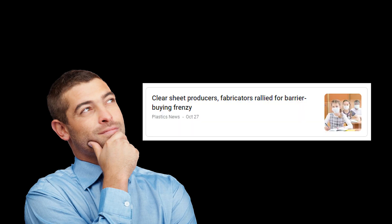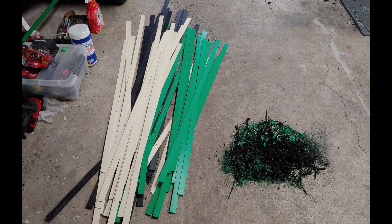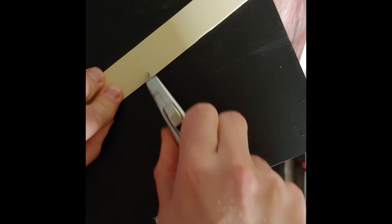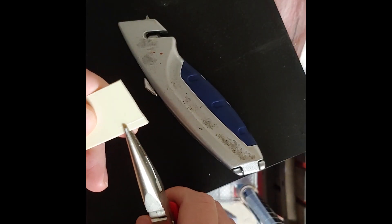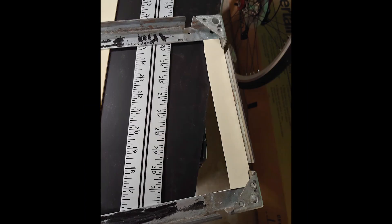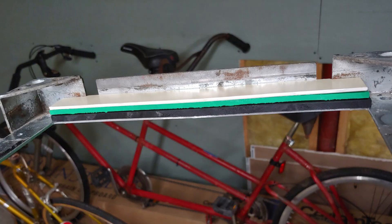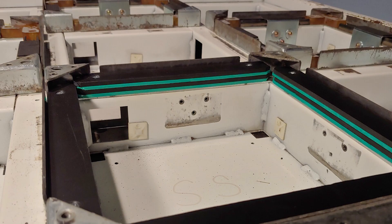Plastic sheeting is pretty expensive, especially in COVID times, but luckily I found someone on Craigslist who sold me four very large sheets of plastic in all different thicknesses for a total of $20. I used the wrong tool for the job at first, but eventually my neighbor helped me rip the plastic sheets using his table saw. Once I had them in strips, I could make further cuts using only a razor blade — scoring the plastic on one side and then bending it to snap right at that line. For more precise cuts I'd use pliers to bend the plastic. Eventually I landed on the right shape, spending hours making these over and over. Once I had enough, I could stack them, drill holes, countersink the top layer, and screw them down into the frames. I now had a completely flat surface to mount the FSRs onto, and I could adjust it easily by unscrewing the stack.